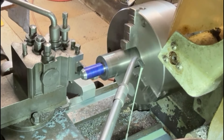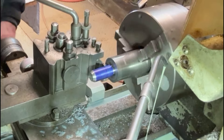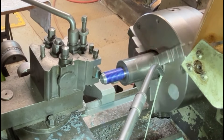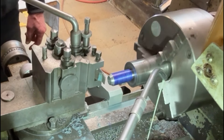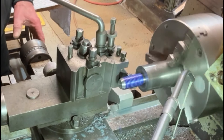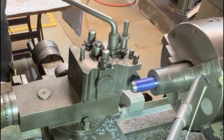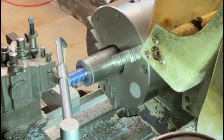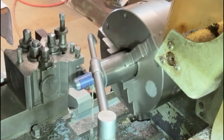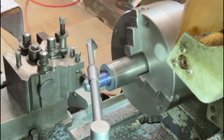Here I'm in the first stage of cutting the thread. I've put some blue onto the shaft so that I can get a better vision on where the thread is going — it's cutting quite nicely. What I tend to do when I'm cutting a thread like this is I run the machine down slowly, and as it gets to the end of the thread I need, I just reverse the lathe and wind the tool post out. That way I don't need to disengage the gear itself, and I can guarantee I'm coming back on the same cutting stroke all the time, so it gets the thread nice and even. Plenty of coolant on it so we don't overheat and it gives a nice clean cut.